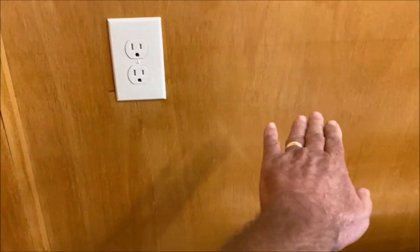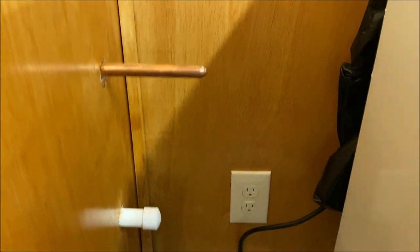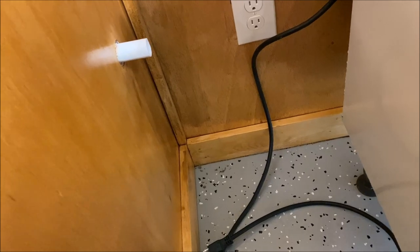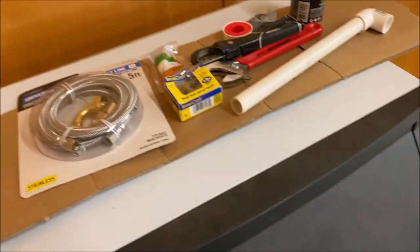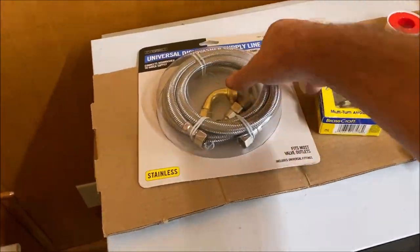every morning. So when we roughed in the building, you know, this will go above the countertop. So we got that down there for the pump and the ice maker. Here's our water supply, and that's probably not glued yet. There's our drain. So I'm gonna set a little condensate pump right there and pump it into that drain and hook this water supply to the ice maker itself.